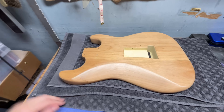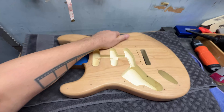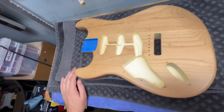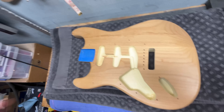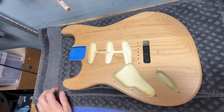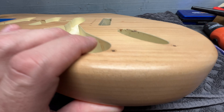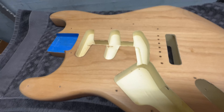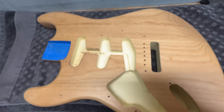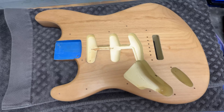We're back on the workbench. I managed to get all that finish removed — sanded down to the bare wood — and went ahead and used the Oxford sealer filler. Unfortunately I followed their directions to a T, but I can still see, and more importantly feel, a little bit of wood grain. So even though that was a high-build filler sealer, it's still not 100% flat, and that will not do.